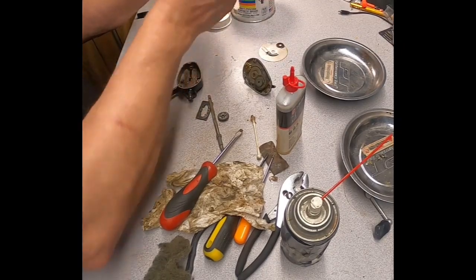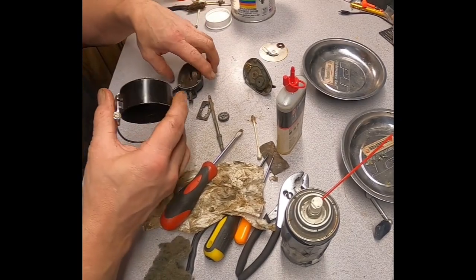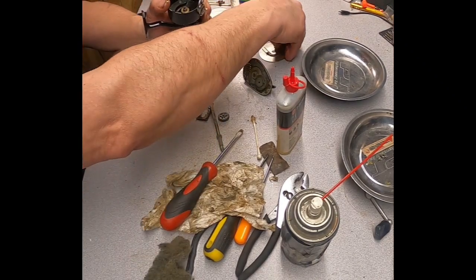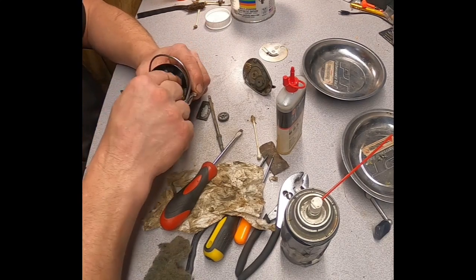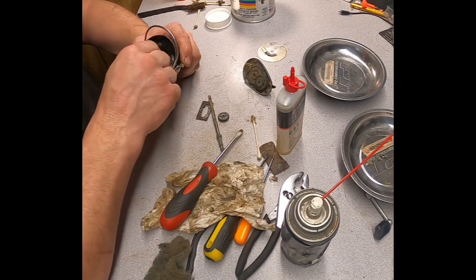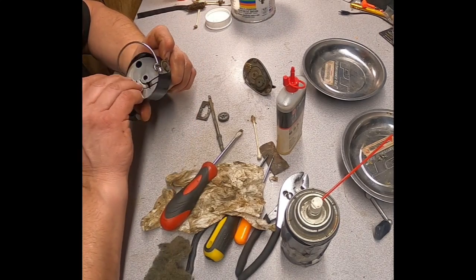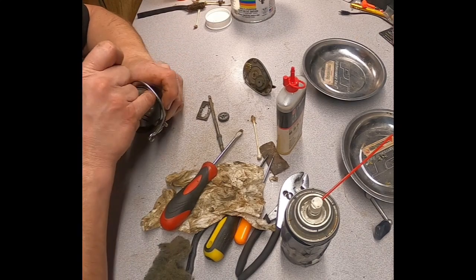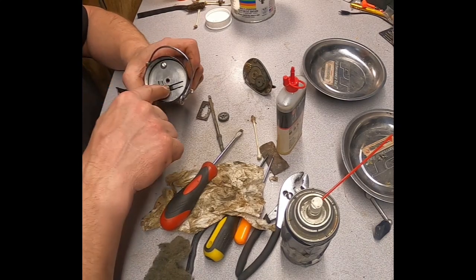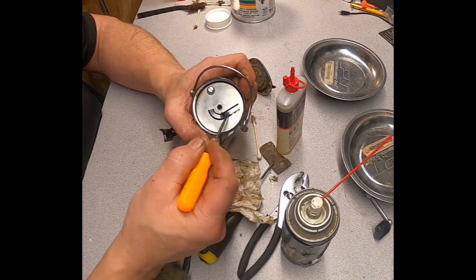Grease the gear. Don't forget the gear. The other gear has grease in it, so I wasn't too concerned about it. But okay. That fits right on there nicely. I have these washers that go on there, like so. They're actually the other way. Brass was down, the fiber was up. This plate sits down in here. There's a notch there that this fits into. If you guys can see, this notch right here fits into a notch on that shaft.